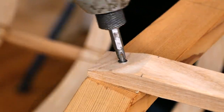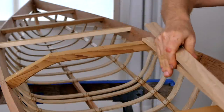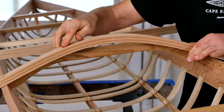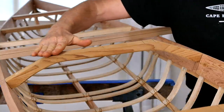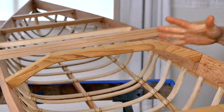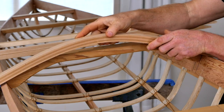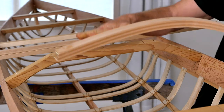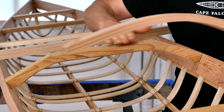Something I often do when I'm prototyping is I just screw things together really quick — it lets me test out different ideas without making any permanent choices. Getting rid of these deck stringers here, one of the big changes we're going to be making today is replacing this deck beam, which is cut out of a solid piece of wood, with one that is laminated — which is how I normally build these boats. The reason I tried a single solid piece was because I thought it would be easier to make this flat shape across the top, but having not built these in a while, I forgot how much more complicated the layout is. Another advantage of going with a laminated deck beam is that it's a lot stronger, and especially the connection to the gunnel where the tenon goes into the mortise is significantly stronger.